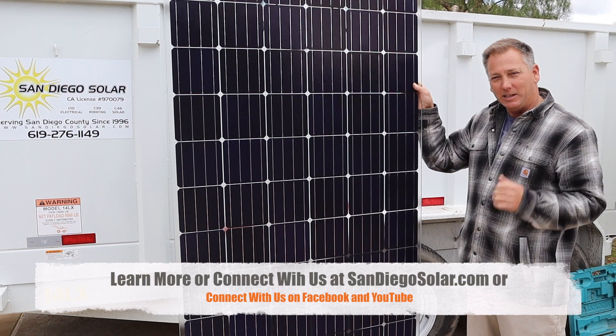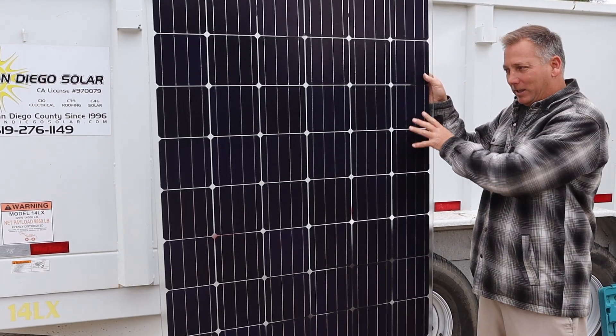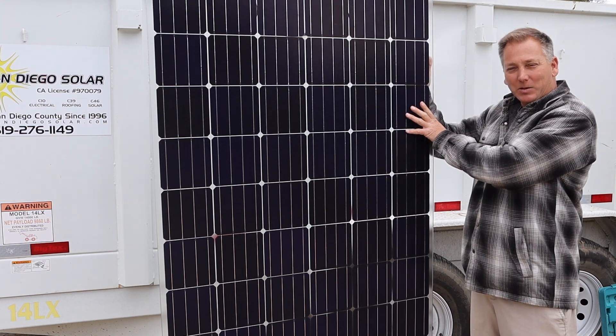There's no frame around it, so it's going to look like glass on your roof. In this case it's going to be a ground mount where we're going to put white rock underneath to get reflective energy hitting the back side of the cell, which also generates additional power.